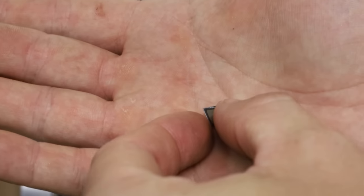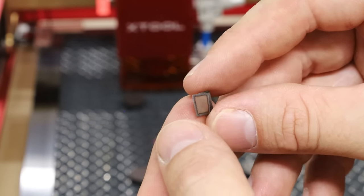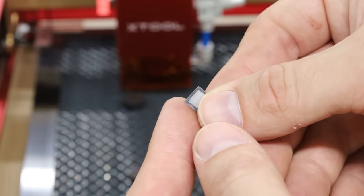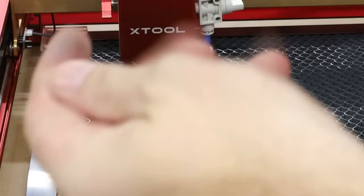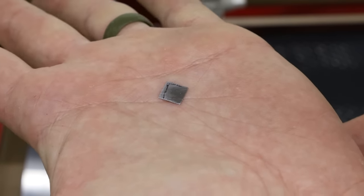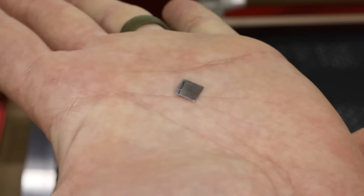This was the second pass — we got clean cuts on the 2 millimeters a second at two passes. I'm pretty sure as far as that oxidation goes, I should be able to sand that out. These are so small it's kind of hard to get a good grab and really sand them, but you can see that with a little bit of sanding you can take off that oxidation and get it back to just the steel itself. That's pretty epic.